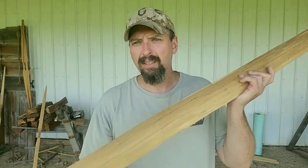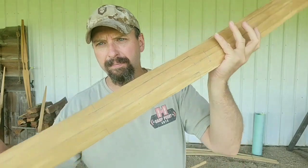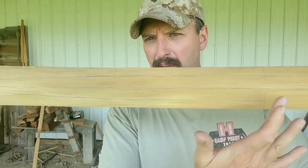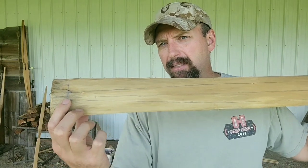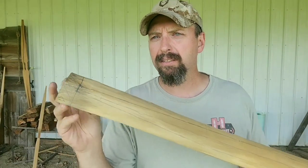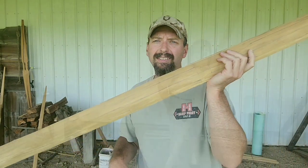It's been a little while since I've touched this black locust flat bow — this was the stave I got when I was in Vermont at the Osage class. So I've got it all laid out. Got that classic flat bow style, where it's got a slight taper for the first two thirds of the limb, and then the last third it's got quite a sharper taper and it meets for about a half inch nock here. I've got some cut marks here on both ends, maybe an inch or so. I'm going to cut those off and then use my hatchet and hew these down to the lines.